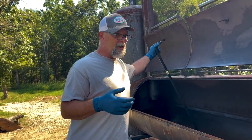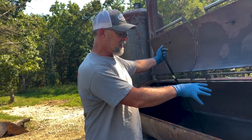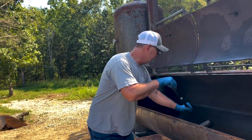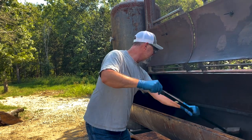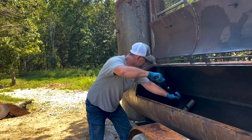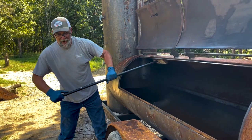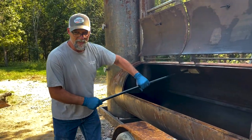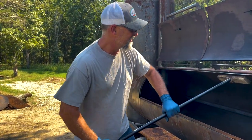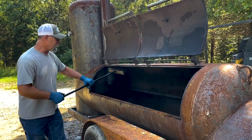The goal is that vegetable oil has a lower smoke point than a lot of other things. What we're trying to do is get this oil to polymerize on here — burn it really, really hot. That polymerizing is what makes that seasoning coat that doesn't wipe off. Always wash the top of your cooker because that's the crap that falls on your brisket that you can't see when it gets absorbed into the meat. It's a food-producing appliance — you should take care of it and keep it clean.